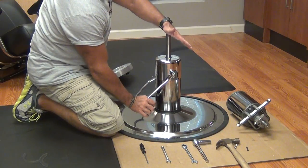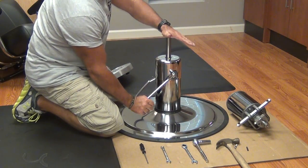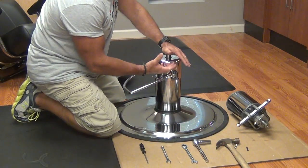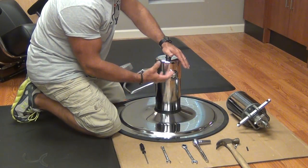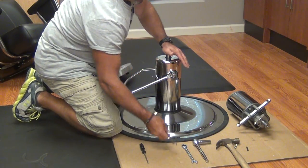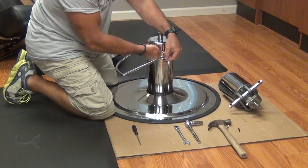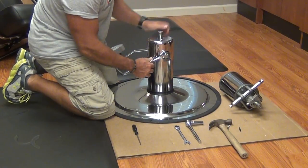The other thing you're going to do is return the pump shaft to its lowest position — hold down the treadle, push it all the way down. That will make it easier to get it back in the box whenever you return it to Collins. Now we'll take the seven-sixteenths wrench and loosen the bolts that hold the treadle in place — there's one on each side.